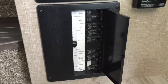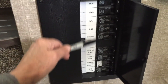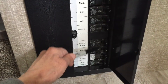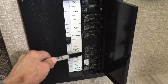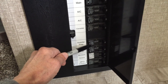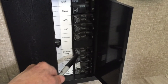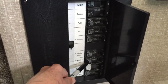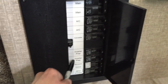The way this panel is designed, it actually has a break — there's a bus bar that runs all the way through, and it's cut right here. So these inverter prep breakers are on a separate run, with a loop that goes all the way to the front compartment and back. Now that I have that loop going to and from the automatic switching system, I'll mark this one as 'to the inverter' and this one as 'from the inverter.'